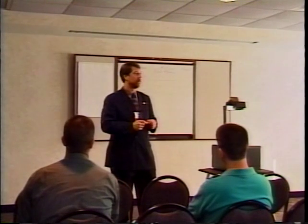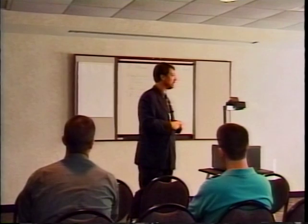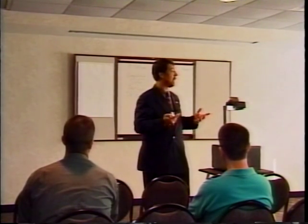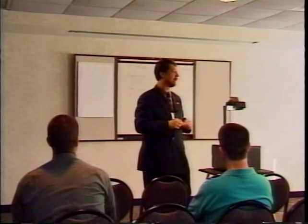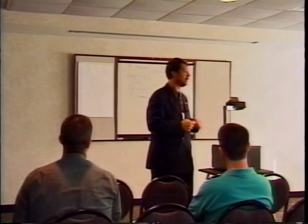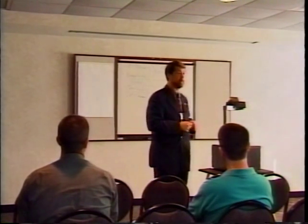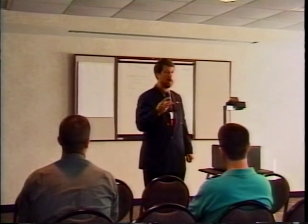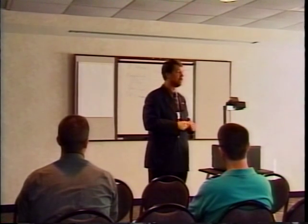And so then when I got into teaching, the students asked some of the darndest questions. Well, then we just started drawing the escapement, and that made me a whole lot more familiar with what the different terms were and why the clearances were such that they should be. But it really wasn't until I went to WOSTEP and I just simplified it with the four: corner clearance, guard pin clearance, total lock, and safe lock, and that, bingo, everything else just falls into place.